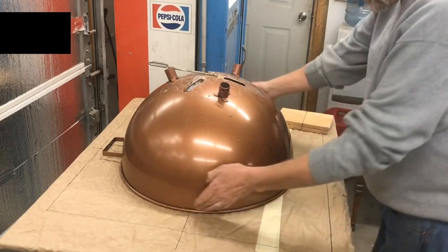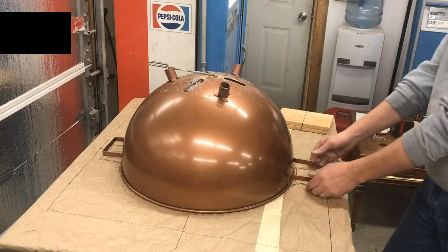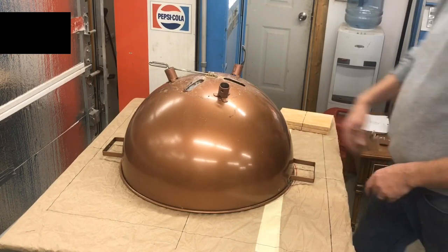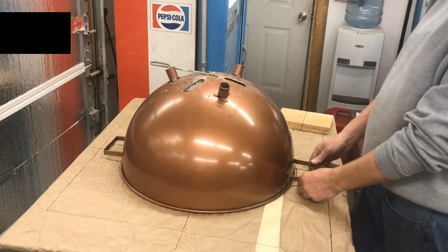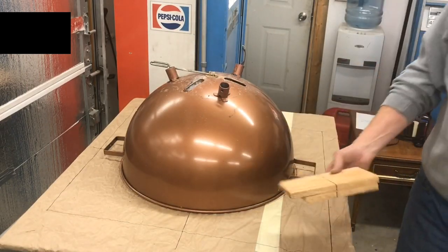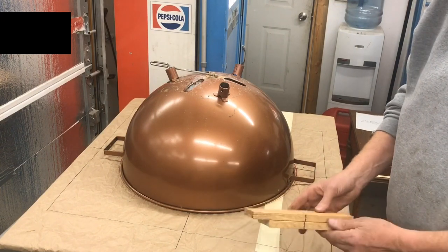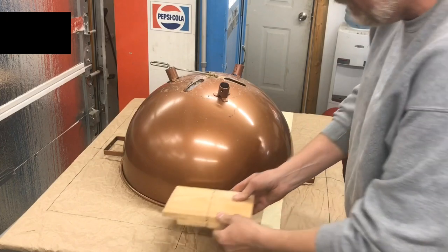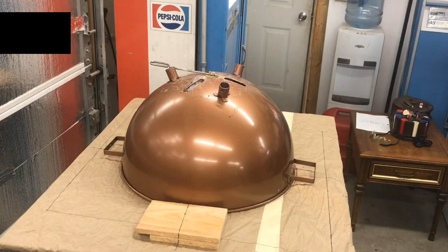I have my center line marked here. I have my kettle sitting in my circle, so I have it pretty well eyeballed on center line. Your bracket handle has a hole right in the center, so I'm eyeballing that, making sure I'm lined up. I'm going to call that good. I have a piece of half-inch cedar fencing — I made a mark on the center line, it's six inches wide. I cut a little spacer, and what I'll do is line up those two lines so I have my center line and my one-inch space down.